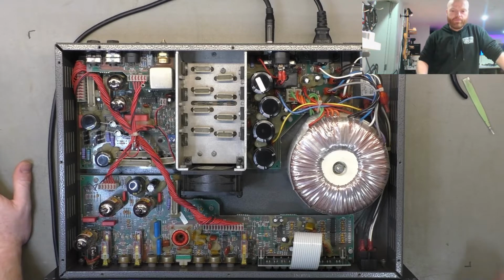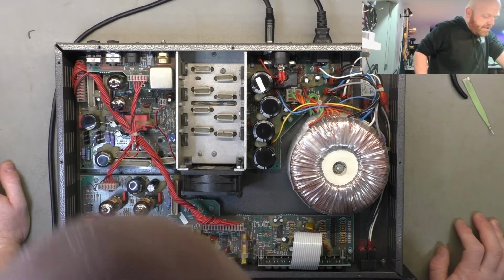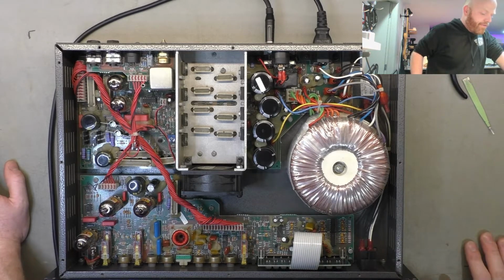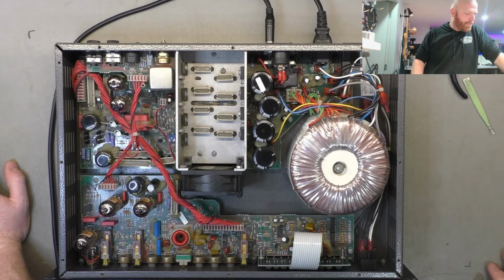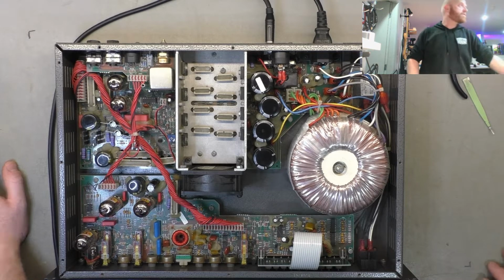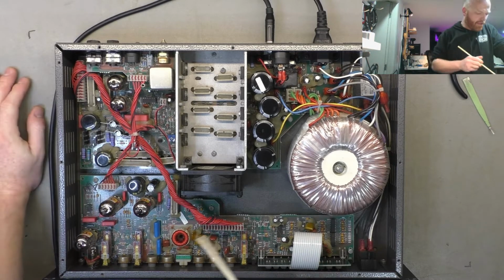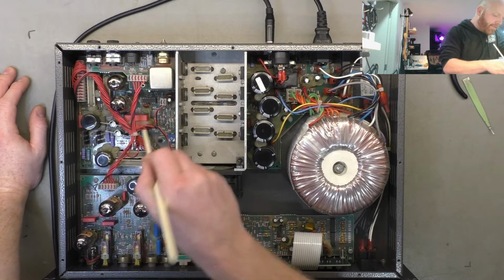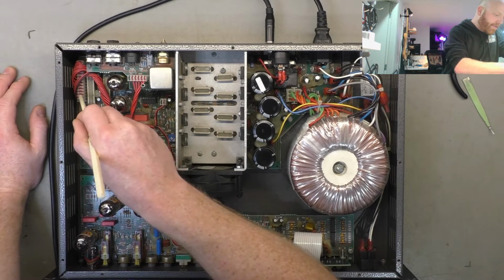So it's a pretty well-known issue on these things that the circuit board's pretty crappy, very thin traces, similar to the Fender Hot Rod series. No through-hole plating, just single face. They crack their solder joints ridiculously often. Despite the little globs of silicone everywhere. So we'll try and pinpoint what was triggering that relay to click. Could be the connector.